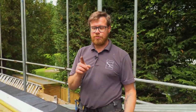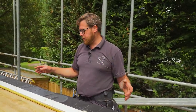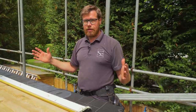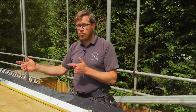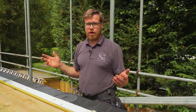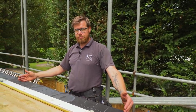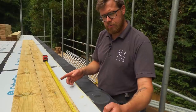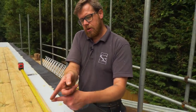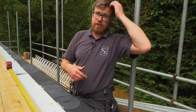What you're talking about for the boards is not OSB — it's render carrier boards. So I'm working this out primarily for the render carrier boards on the outside, because they're quite expensive and I don't want any wastage. If we've got to cut a foot off and throw that bit away, that's not good. So I'm setting up primarily for the outside boards. We're still setting all of our studs at 400 centres. What we do internally is we don't start our plasterboard right on this corner — we start one stud in. And then we've still got 400 centres, working out with just one cut to fill in at the end.